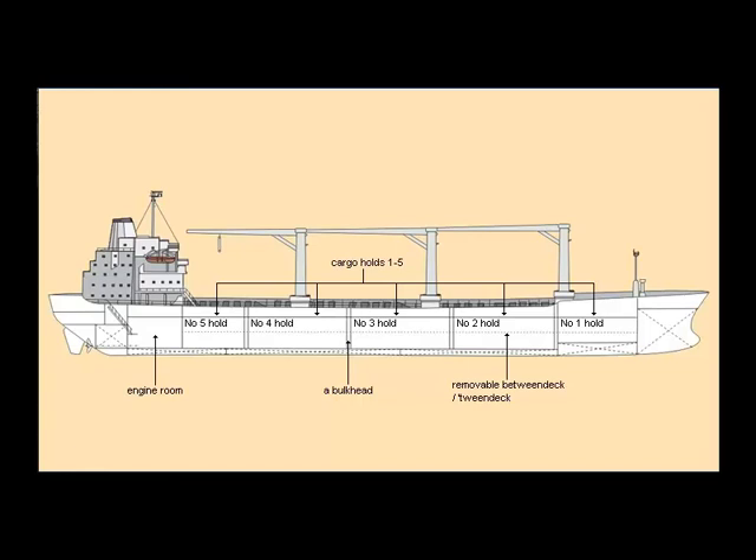The whole body of the ship is called the hull. The outer surface is called the plating. On the marina, the hull is made of steel. It's strengthened to meet Lloyd's Register Ice Class 1A requirements. This is necessary as she is in traffic in the Baltic Sea. The space between the cargo holds and the bottom contains the double bottom tanks for ballast and sometimes for fuel.